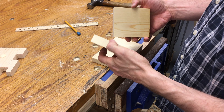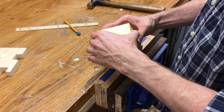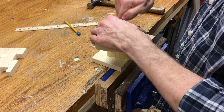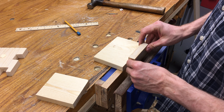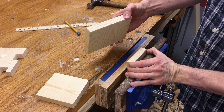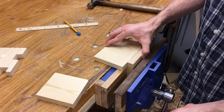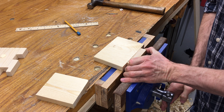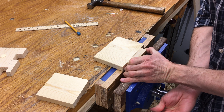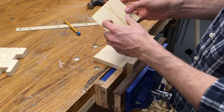I found it a little bit tricky to put these together without a second set of hands, because we're going to glue the end and place it here and it seems awkward — how do you hold it and hammer it? What I thought would work well: if you have a vise or clamps, take a scrap piece of wood and set it at the same height as the piece you want to nail into, clamp it in the vise, get it as even as you can, and tighten it down well.